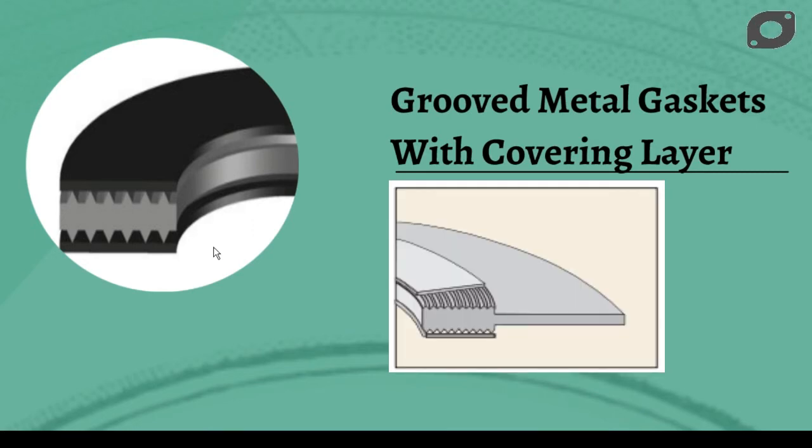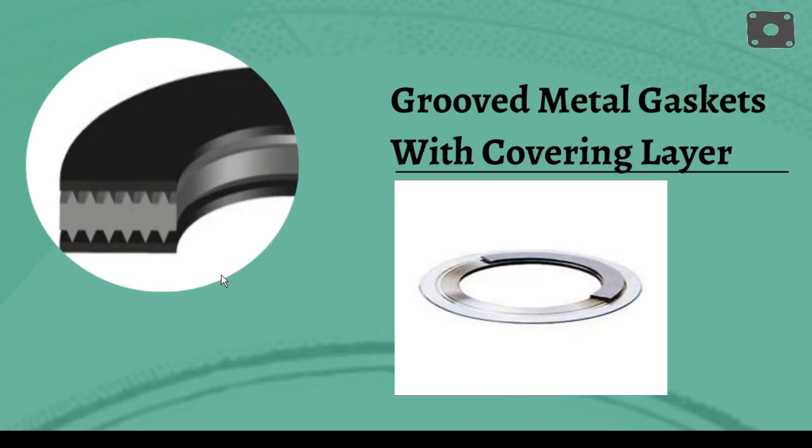For flange protection, the solid grooved metal core gaskets are normally used in conjunction with a covering layer with soft conformable facing materials bonded on both sealing surface faces, of either PTFE, graphite, aluminum, or silver, thus providing total protection to the flanges and a secure seal even at low minimum surface pressures. In this way, the flange is completely protected from the grooved profile of the gasket.